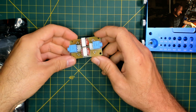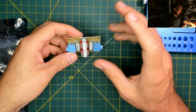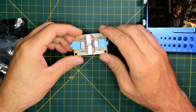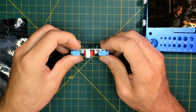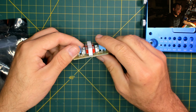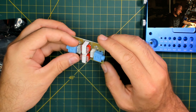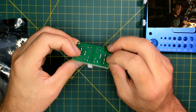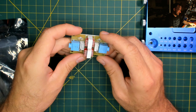This was something else I picked up from Banggood. This is actually supposed to kind of insulate the ground for auxiliary in. It's usually meant for a vehicle. I was going to use it on this project, but it seems like everything's good. I fixed the common ground issue and there's no noise whatsoever. So technically this is kind of useless, but I could use it somewhere else in another project.